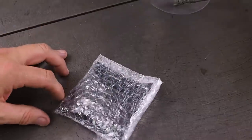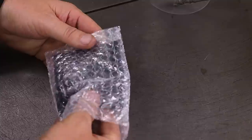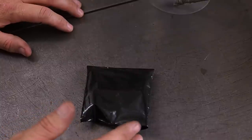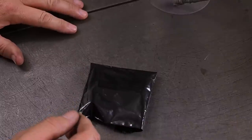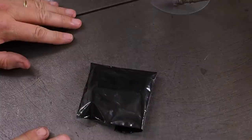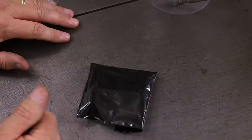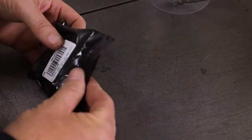Now the next thing we need to talk about is open loop or closed loop control systems. Think of it this way. You had a couple too many beers, you get up in the middle of the night, and you need to bleed Percy. Now, you could turn the light on, see where you're going, and navigate your way to the bathroom. That's a closed loop system, but you'll probably get in trouble for waking someone with a light. The other option is you use an open loop system. So rather than turning the light on, you know it's four steps from the edge of the bed to the door, then turn left, another four steps into the bathroom, drop your Dax, and have a shot at the bowl. That would be an open loop system.